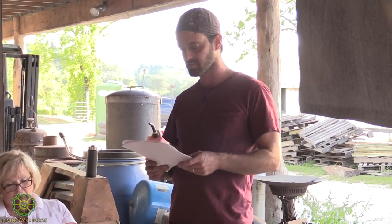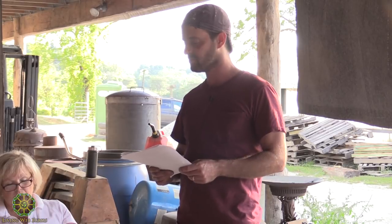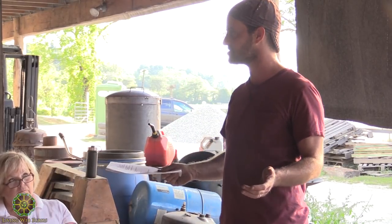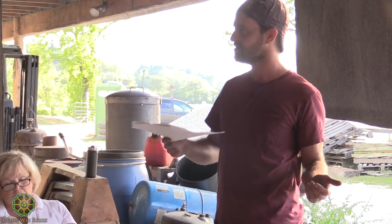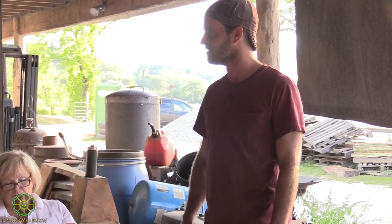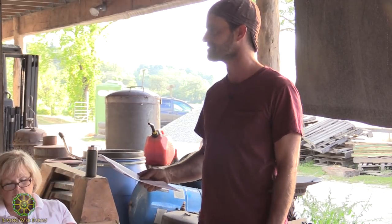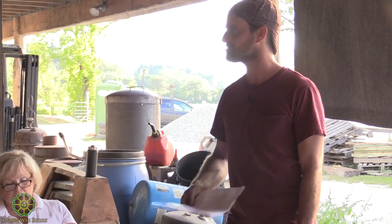Different materials, different melting points. You guys know lead melts very low, like I said, in soldering. Aluminum, 1218. That's a pretty easy temperature for us to attain with our oil burner that we've been working on lately. So we know we'll be casting aluminum, playing around with that. Cast iron, 2200. We might be able to do that. We'll see. Steel, 2500.